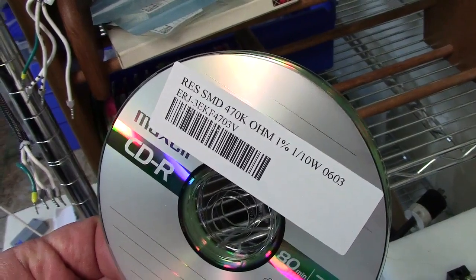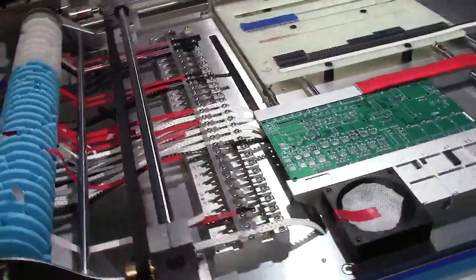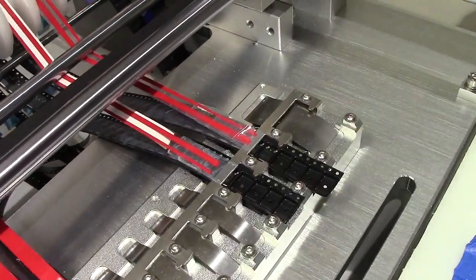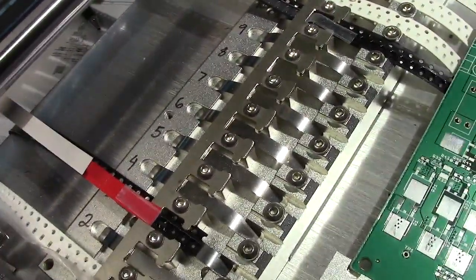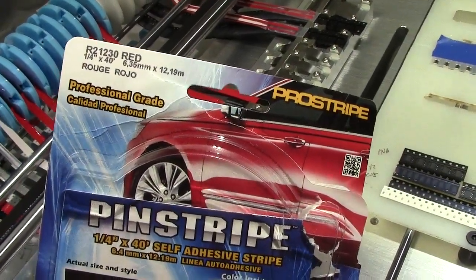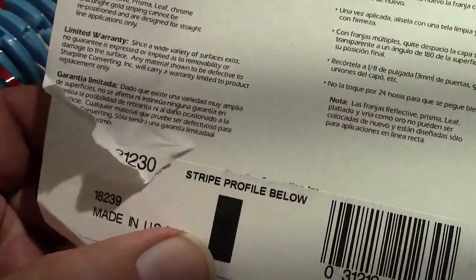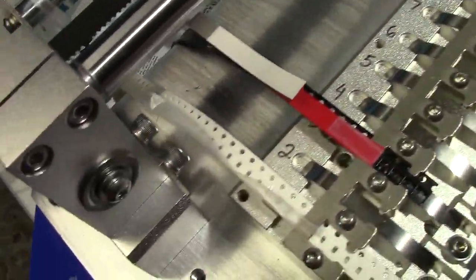Each spindle has a label with part number, description, and a barcode. The up camera just has a little dust cover on it. I have a few really wide parts up there on top — those are N-channel MOSFETs. There are about 10 different parts on this thing. For the tape extenders, I bought some ProStripe down at the car parts place. It's a quarter inch and it fits right on there, so I just put those on and they worked okay.